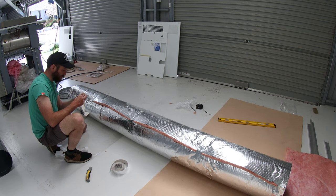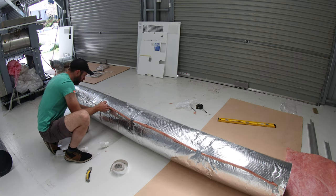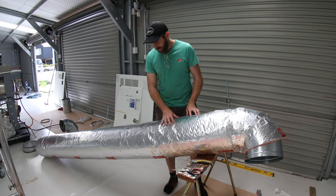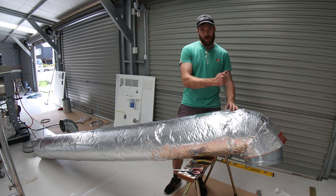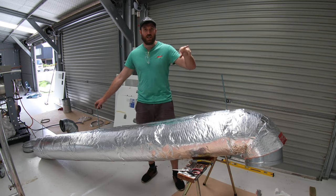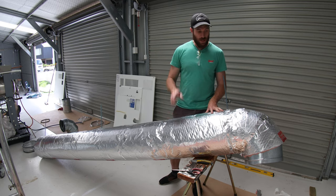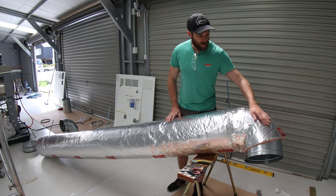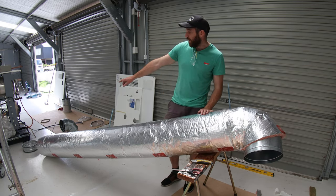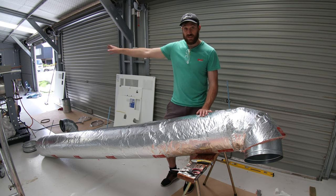The insulation is on and it's wrapped around, and then we're just sealing it up with foil tape. We have the pipe insulated and we've got the braces inside it which are mounted to these connection rods, and these will screw up into some points which have already been drilled into the roof. So the goal is now to mount this big section up there. You can see I've insulated the right-angle corner here most of the way around. That pipe will feed down the wall there and out towards my pre-conditioning room, and that end will join to another section of pipe which will go a bit further — six meters in total — and then down into the fruiting rooms.